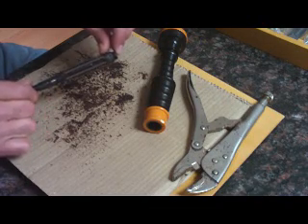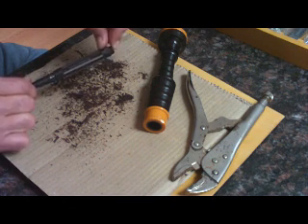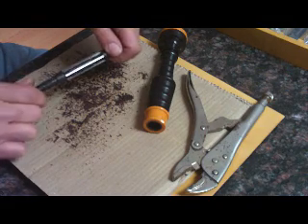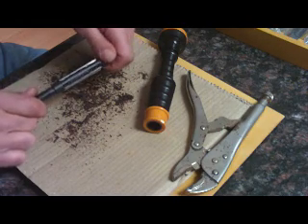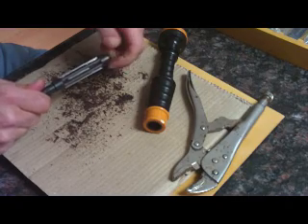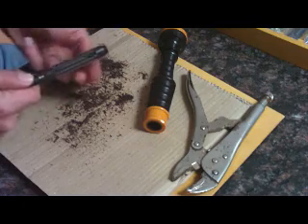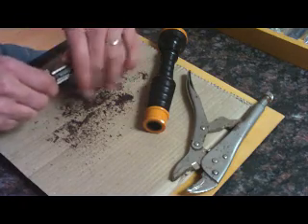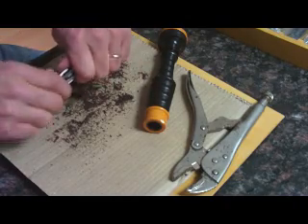The reason they're not ideal is because there's a nut at the end which doesn't go into the bore, so it leaves a portion at the end where you can't ream out a taper. These are a little big. I just finished the other tenor — they're really simple to adjust: just loosen the screw at the top, tighten the screw at the bottom, and that adjusts the size of the blades.